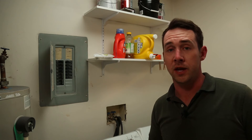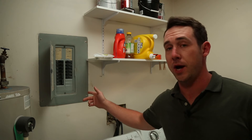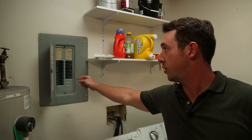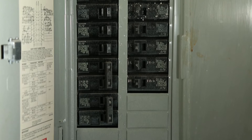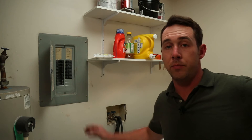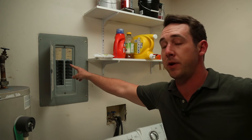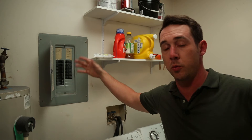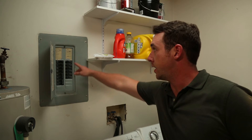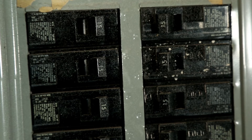So when you're lighting something and you're trying to figure out how many amps do I have to play with, you can find out all that information right here in the breaker box. If you actually open up one of these, you can look at the buttons on them, and you'll see that you'll actually have either 15 or 20, kind of like it's marked here. Some breaker boxes will actually be labeled. As you can see, I've got a couple pieces of tape up here that tell me exactly which breaker is going where. Let's just say for an example, I'm trying to plug in all my lights inside of the hallway. If I look here at the list, it actually says that the number two breaker is the hallway, and if I look at the breaker itself, it says I have 15 amps to play with.